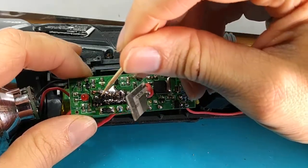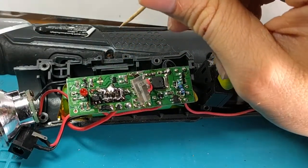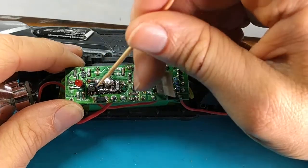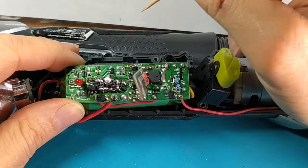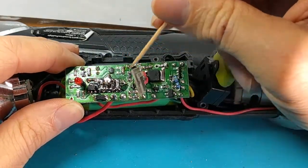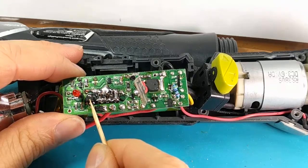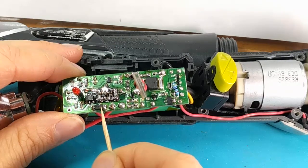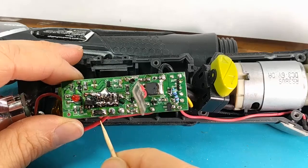This is the charging circuit, which I haven't totally reverse-engineered. I think it's just a very low-current charge — basically like the third state of the charge cycle, because lithium-ion batteries have three-state charging. This is basically like the float, because it's pretty slow. That way you can always do the third state and not damage anything, but if you do the bulk state charging all the way through, you can damage stuff. You've got four resistors here and what I think is a PNP transistor — I have to double-check — but I believe it's a step-down voltage regulator, an LDO. Then there's a diode here as well, which might account for some of the voltage droop.